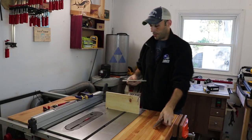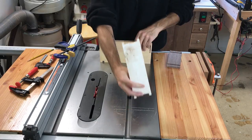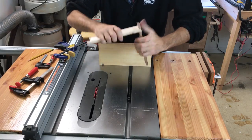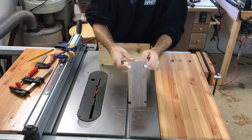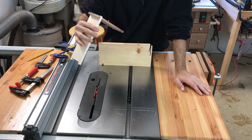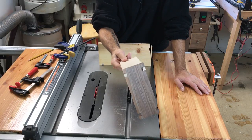Let's take a look at that. Here is our work piece after we've cut our tenons, and let's go ahead and do a fit. We've got our dado and our notches here, got our tenons — let's fit them together. And that is a notch and tenon joint. That one looks very good, everything looks tight, the tolerances look nice — very nice. A little sanding and everything looks really good.